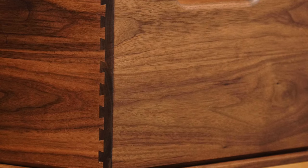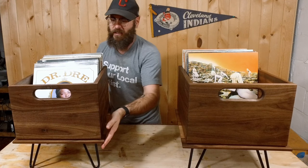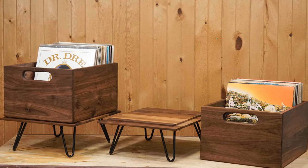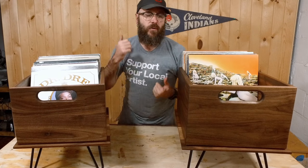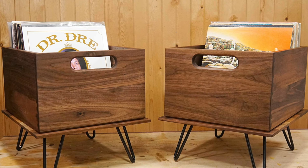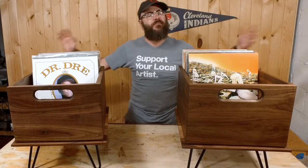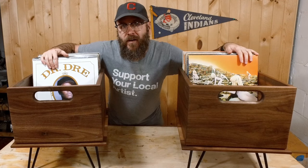Really cool — super happy with the way it came out. The fit on there is perfect; there's just enough looseness for it to expand and contract. I do want to point out that the bottom of this crate is not glued in — it's free floating with room to expand and contract. I usually use plywood bottoms for my boxes and you don't have to worry about that expansion, but this is all solid wood, so you don't want the bottom to expand and blow out your corners. I will have plans for these crates on my website at makesomething.tv. Thank you guys for watching — I put out videos almost every Tuesday and Thursday. Please subscribe to keep up with what we're doing. As always, have fun and make something.